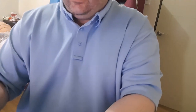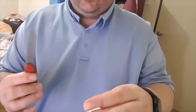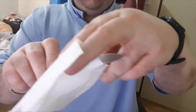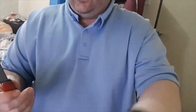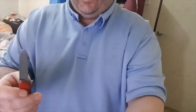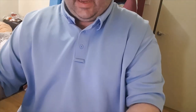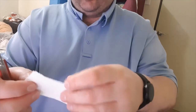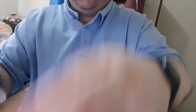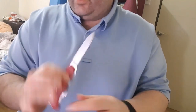This is why I find that if you really use your knives a lot, you're not going to make them so thick to try and protect them. You're going to want to make them at a geometry that cuts easily. Interestingly, even though it's a much thicker edge, you'll see it got damaged on the kebab stick or the plastic bottle, because so much force is required to go through that it deforms the edge a little bit. I'd have to show that on a microscope, but won't do that now.